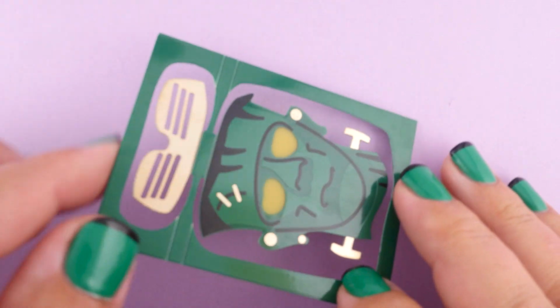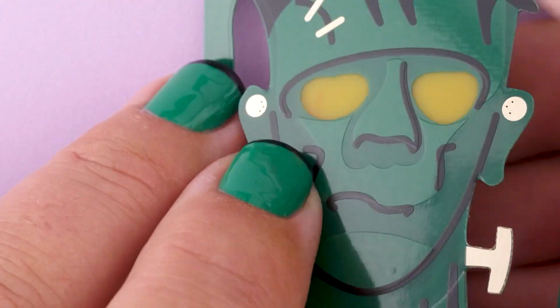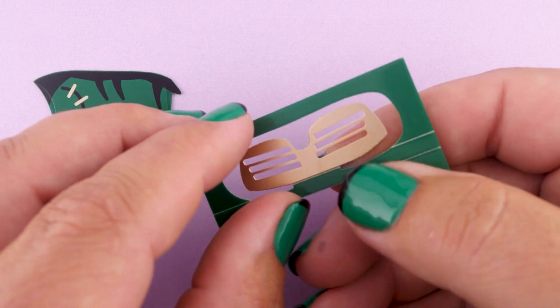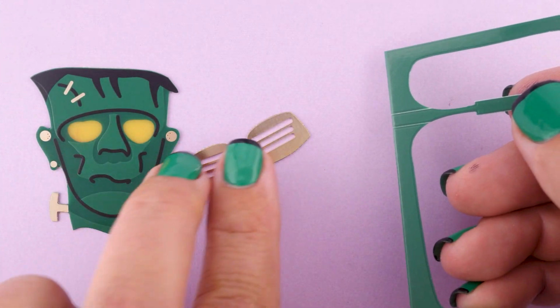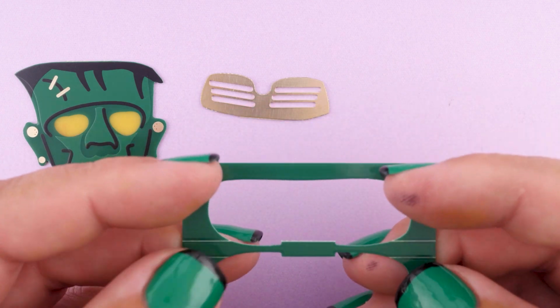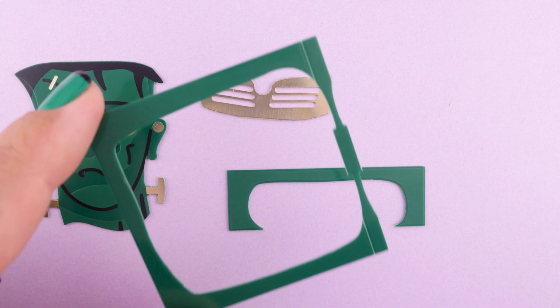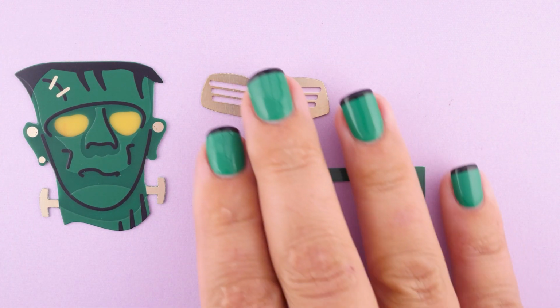Now back to the front side, notice these scored lines. These are called V-cuts, and it's what we use to detach one part of the PCB from another, so we can just pop Frank out like that. And Frank's optional shades should pop out just as easily. Now we'll also snap off and keep this top bit. You'll see what it's for soon. And this square is needed for manufacturing, but now it's unfortunately waste.